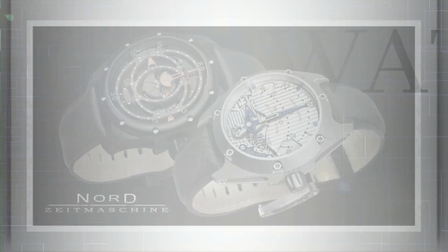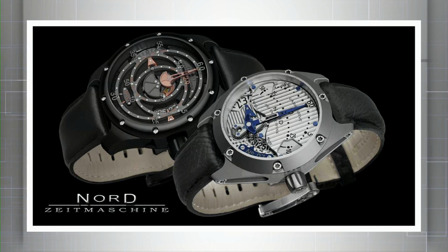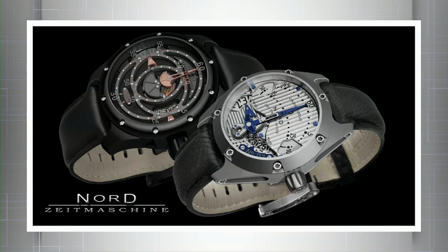You should. They make about 30 to 50 watches a year. Daniel Nebel has been building watches under his own name since 1998, but it was 2011 with the Vario Curve, the silver dial watch on the right, that he really made his impact. Formerly a machinist, now a watchmaker who makes basically everything in-house and finishes it. He uses ETA 2824 bases because they're tough, they offer a lot of torque, they're easily serviceable, and he matches them with monstrous modules. Here are his 3 stars.